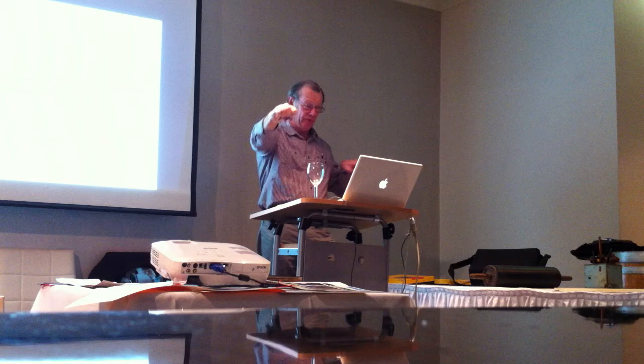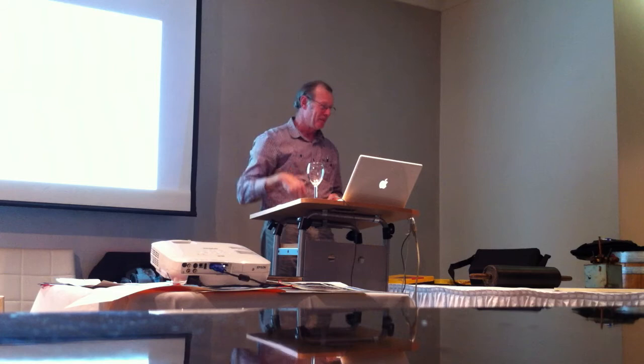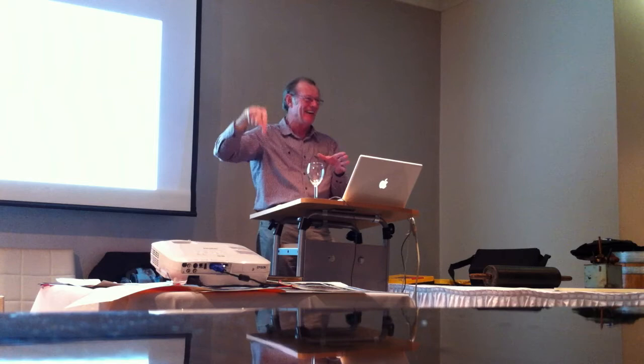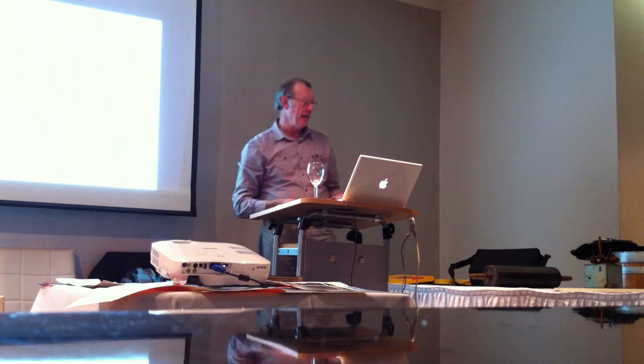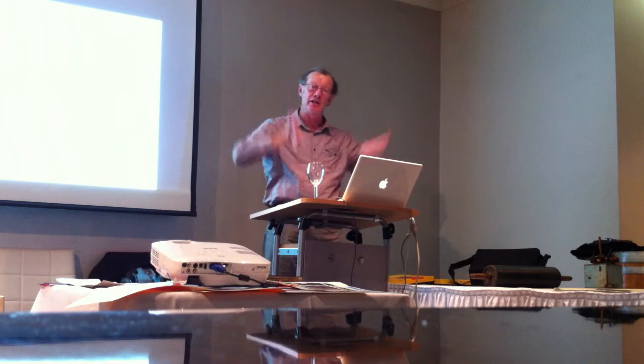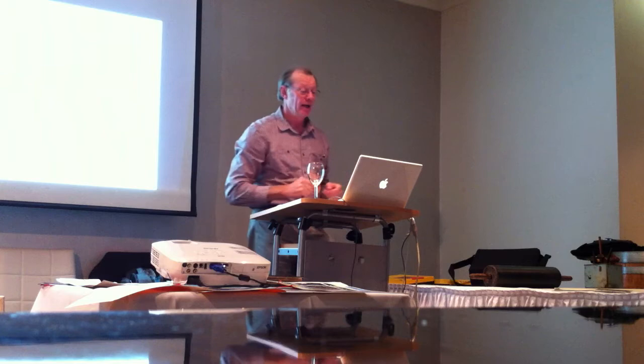you could go around. Now some of them, the ones I used to curse, were like graphs or things where there's a lot of tables, because I used to have to deepen all those little areas between those black lines and the graph, so it wouldn't pick up the ink. That was all done by hand. You can see on these here where it was routed out, and eventually the router you cut right down, cut the image out altogether. So you would actually deepen those wide areas of wide open space so that you wouldn't get any dirt ink picking up in there. Okay, some of you might remember the cartoons that did that.